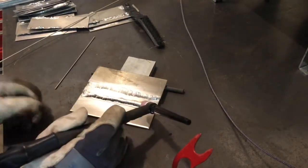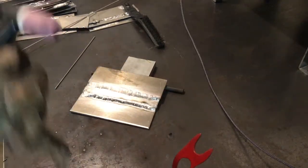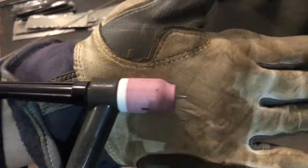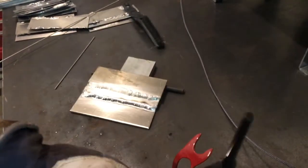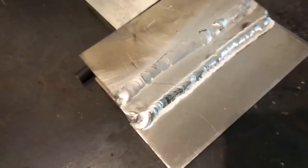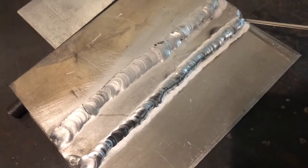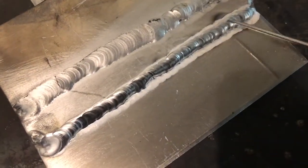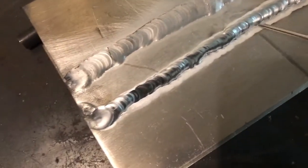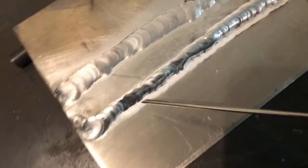I tried to get a nice tight arc. As you can see, as I was going through the motions I kept almost touching — I wasn't dipping but I was really close. There's nothing on there, or maybe I had just too much of a point. So here's what I've learned as a rookie: when doing a lap joint, you have to really get your arc pointed in the middle of the lap joint direction. You have your top and bottom piece but you want to get your electrode pointed right at the middle. Once you do that and get a consistent bead going, you can wash the puddle up and down slowly — if you do this, you're okay.